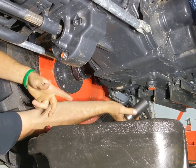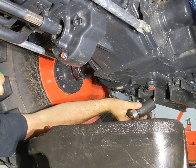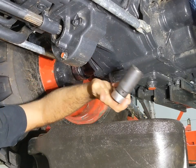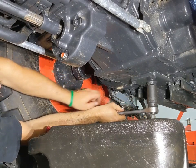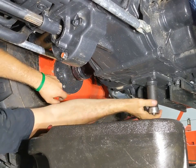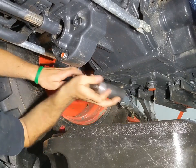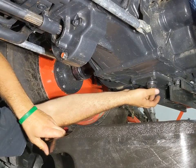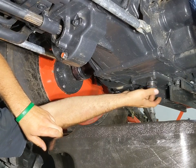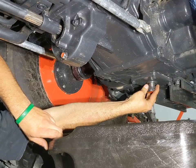I've got plenty of light under here — I did add a flashlight to help light everything up for the cameras. We're going to grab our 30 millimeter socket and break our drain bolt free under the transmission. This one usually makes a pretty good mess just because of the rate that it comes out. To help with that, I am going to keep the fill plug in it.